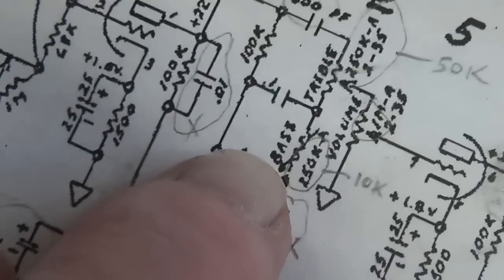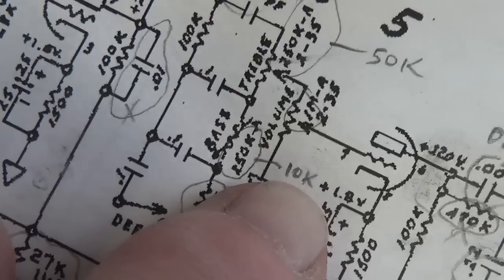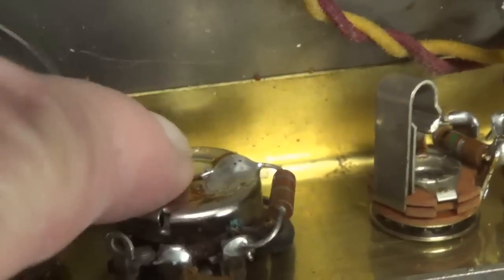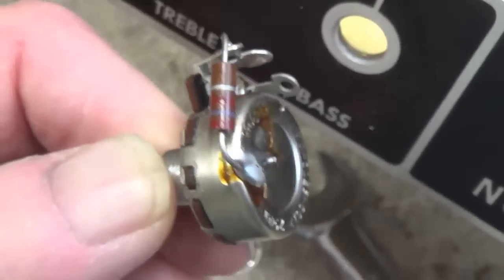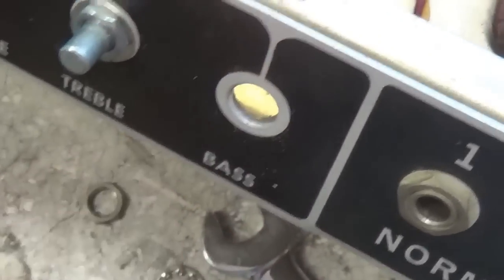Next, we'll look over here at the bass tone control and see that it goes from 250K audio down to 10K. Yeah, I know that sounds like a tremendous difference, but that's the way it is on the schematic. Okay, so let's change that one. And we see that the 2.7K resistor goes with it, and it is here connected on the back, so we'll leave it attached when we remove the pot. Out comes our original 250K bass tone pot with the 2.7K resistor attached, and in will go the new 10K